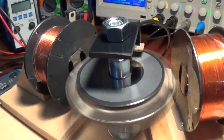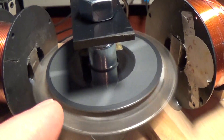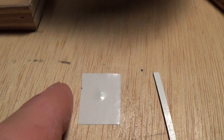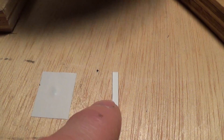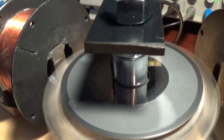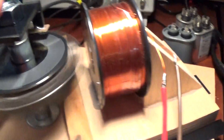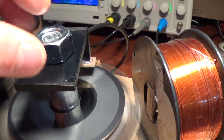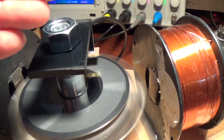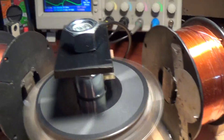Hopefully this will be a quick update. I wanted to now tune the pulse width — the on-time of the drive coil. This was the width I had before, and now I'm actually down to a very, very small pulse width. I've increased the voltage to just about double what I was using when I first demonstrated this, and now the assist coil, with a very specific and very sensitive timing position, is participating pretty well close to 50%.